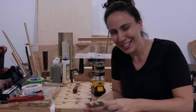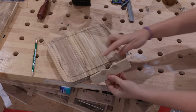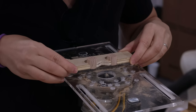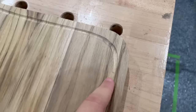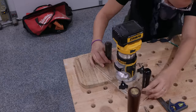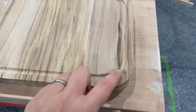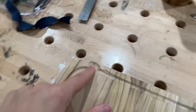I couldn't let it go — I had to figure out a way. So I took that piece with the notch and drilled some holes in it, then put some dowels into it. What I'm hoping is that the two points of contact stay on the edge, and as I get around the curves the curve of the dowel goes around the curve of the board. First pass — not so great. After a second try I'm going to give up. There's just too much risk that you won't turn at the correct radius or at the right time. If you go super slow you can achieve a good radius, but there's too much risk for failure and the other ways just work so much better.